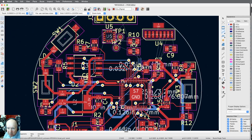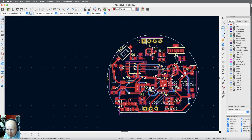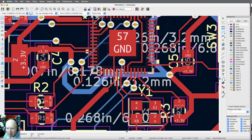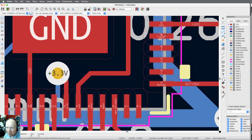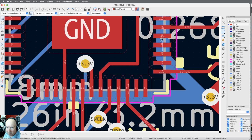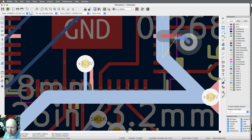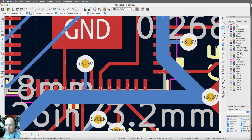Now I've got these 3 wires. We're getting pretty well cleaned up down here. I don't see much left. Oh, we've got this to... Oh, there's a 3.3 there that needs to connect. Okay. Again, the 3.3 will have to come off as red. And then we're going to do a via. And then it just needs to come right back to that trace.